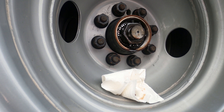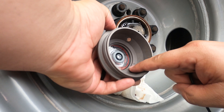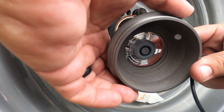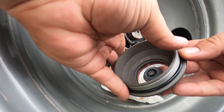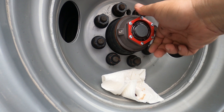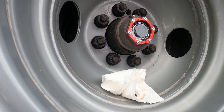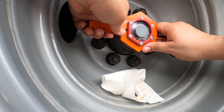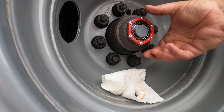Then what you want to do next is grab your new cap, grab your O-ring, make sure there's no debris in it, and clean it out. Roll the O-ring on, screw in the plug, then grab the Speed Cap wrench. This says torque to 25 to 30 foot pounds — I'm just going to put it on basically hand tight, then throw it about another eighth to quarter of a turn. As long as you can't take it off by hand, that's about all 25 to 30 foot pounds is.